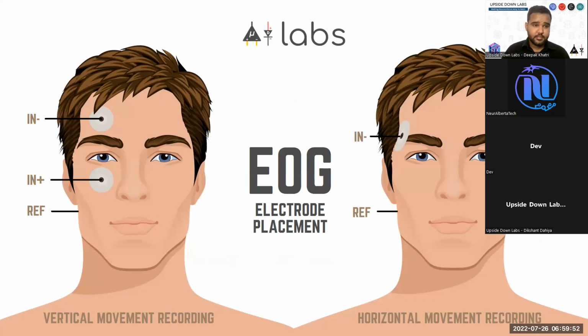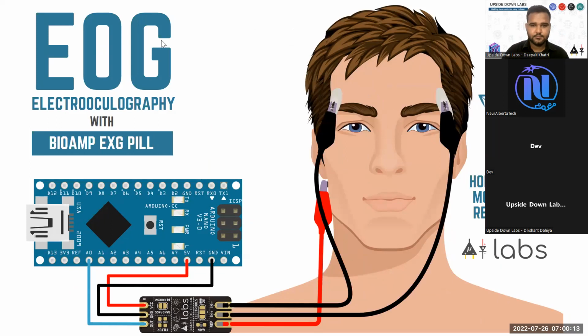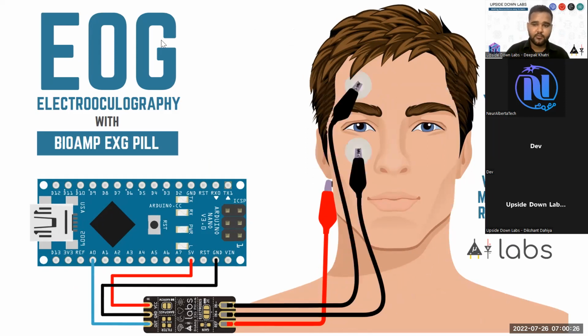Then we have the EOG biopotential recording setup. For that, you tend to go with either vertical recording or horizontal recording. This is how your recording setup will go if you are going to use BioAmp EXG Pill with your Arduino Nano. This is for your vertical, this is for your horizontal movement recording. In horizontal movement recording, you can detect the gaze of the eye, and for vertical movement recording, you can detect blinks very easily.